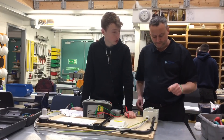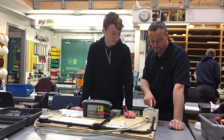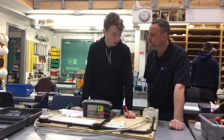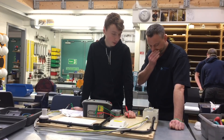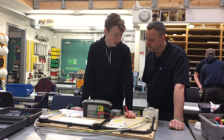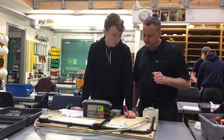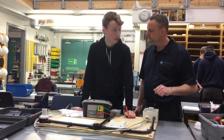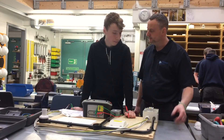In order to do the insulation resistance test, what must you have ensured about your switch and your light fitting? The switches are on. And we've got an RCCB here — you made sure it's in which position? Off. Why did you make sure it was off? Because you don't want to put 500 volts through the electronics. So of course we don't want to pass 500 volts through the electronic components within the RCD. Brilliant. What's the smallest acceptable value of insulation resistance? One mega ohm. And what does mega stand for? Million. Are we expecting a very tiny one mega ohm? No, we expect a massive reading!